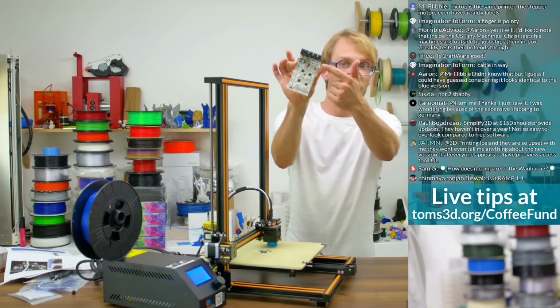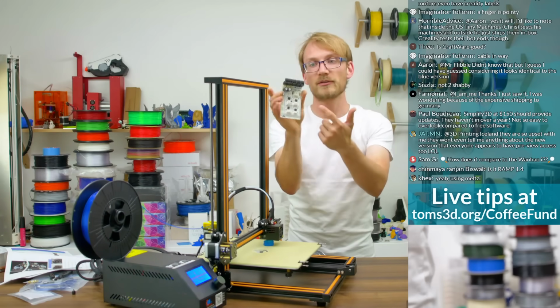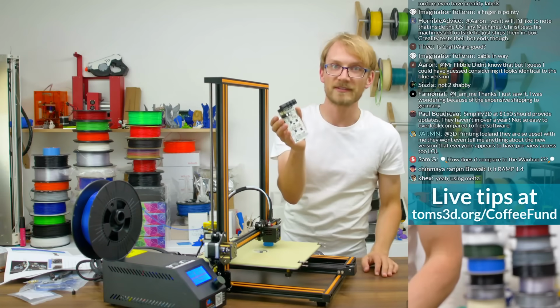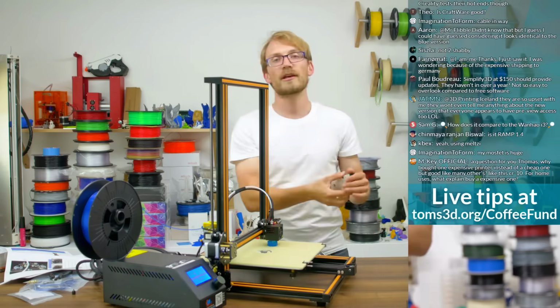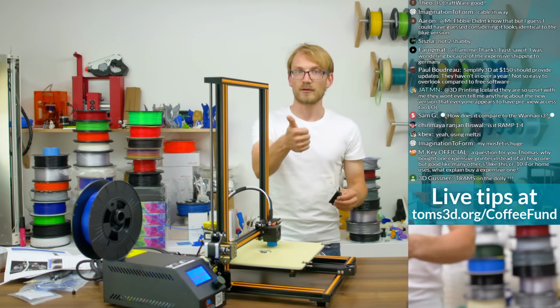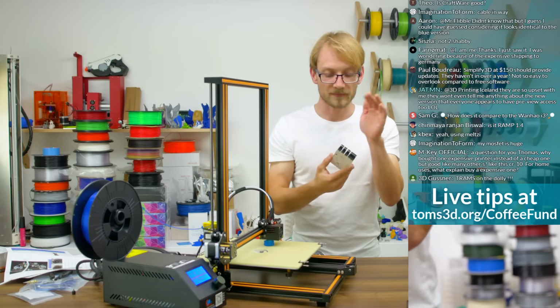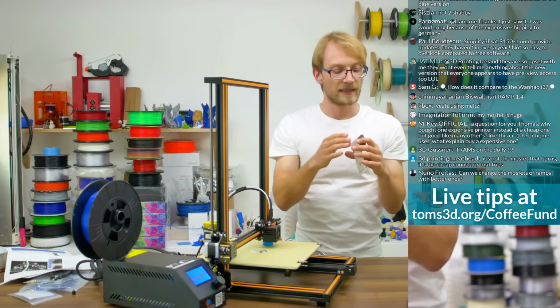On the other hand, if you go with a properly selected and properly engineered solution, like using a MOSFET that is maybe not 10 cents but maybe 50 cents, you can get away from that. You don't have to add all that overhead of adding cooling, adding heatsink, adding all that stuff. If you just use the right components from the start.